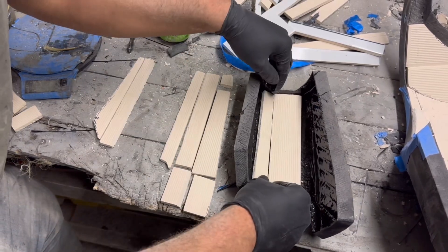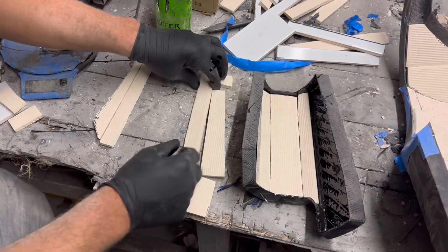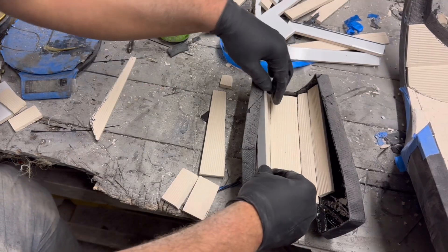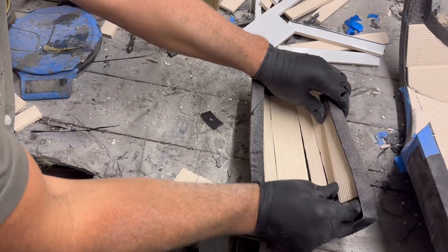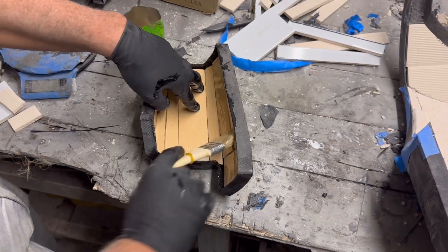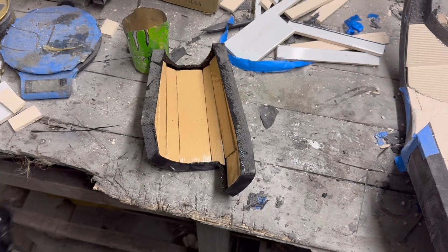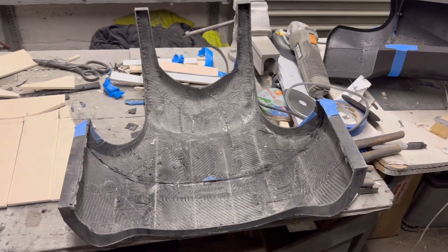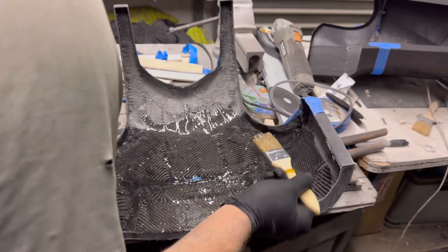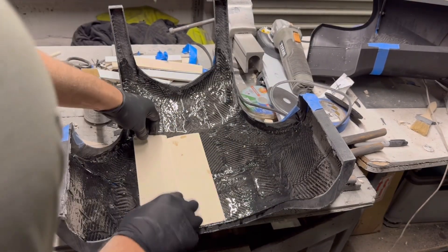You can see, because I tried to design the armor to really only be made out of one-dimensional curves, how even these bigger longer pieces do fit in pretty well. And once they are cut, it is actually quite quick to put together. When I went over the top of them with resin, trying to get into all the gaps, I did make sure that I pushed all of that ceramic together, making sure there were no gaps and cracks between it - or as little as possible. Due to this resin going off pretty quickly, I chose to just do one layer at a time and let it set in between, because as a soft resin it will adhere pretty well to the next layer.